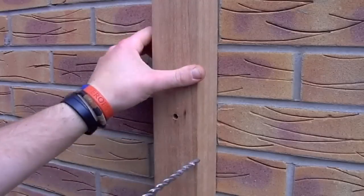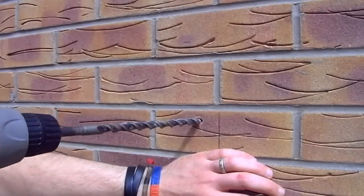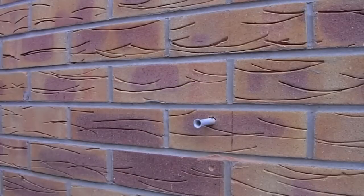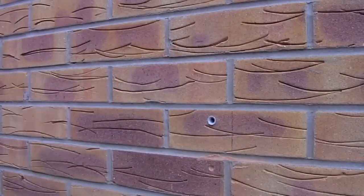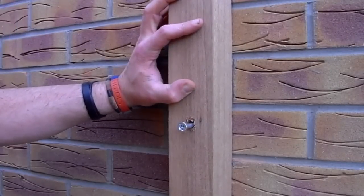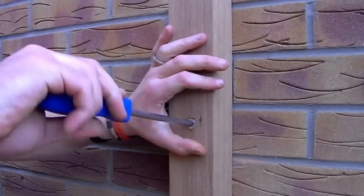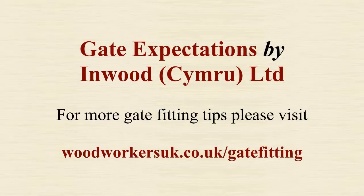Once you've pre-drilled your post, place it back in position on the wall and pre-drill each of the holes through the post — these only have to basically mark the wall. Remove the post from the wall and, using the marks you've made, drill the holes to the correct depth into the wall with the masonry drill bit. Next, push the plugs for the frame fixings into the wall and tap home with a hammer. Position your post back onto the wall, insert the screw parts of the frame fixings through the post into the wall plugs and tighten each one up, checking for plumb as you go. Once secured, seal all round the post with good quality silicone to stop any water getting down there.